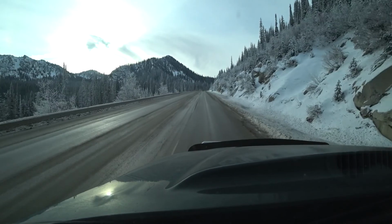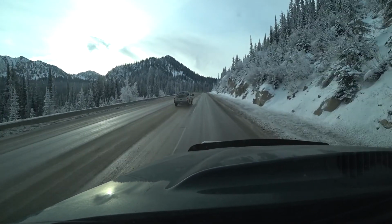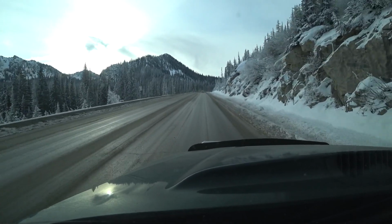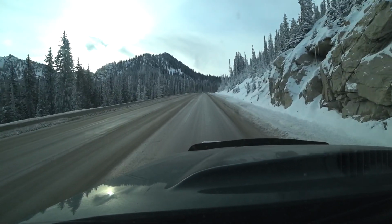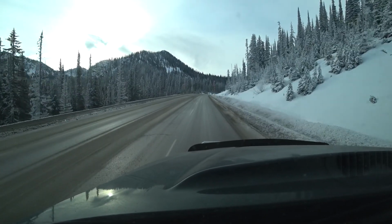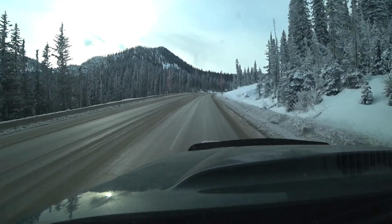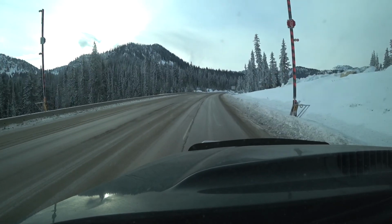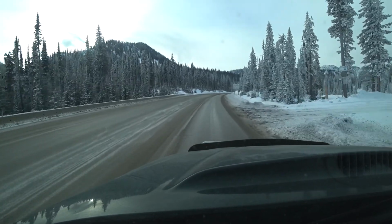As soon as we get to that gate there, I'll turn the power divider or differential axle locks off and the power divider lock off. A little more snow up here. You can see the trees have got a beautiful winter look to them. Okay, diff locks off, power divider lock off. We're back to just one set of duals with power.